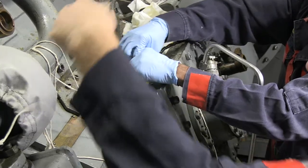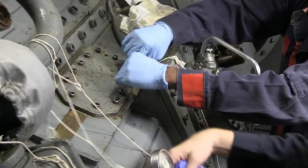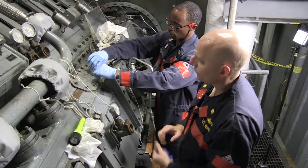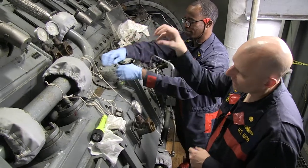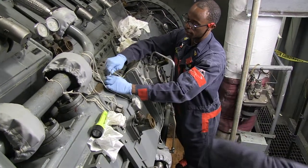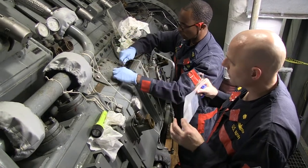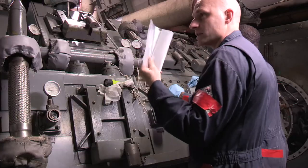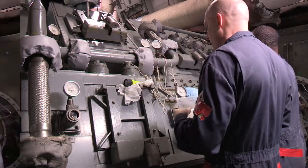While senior is working, I'm going to get a ziplock bag to put all those bolts in. For a lot of equipment in engineering spaces you'll see bolts just put up somewhere, and that's fine for small repairs, but for something like this where you have to keep track of everything, we always want a ziplock bag. As we get those off, we'll put them in, count them, and make sure that many comes out. Don't forget to add the ziplock bag to our inventory list so they know we have it inside the secure area.